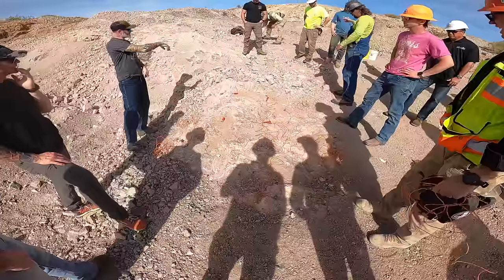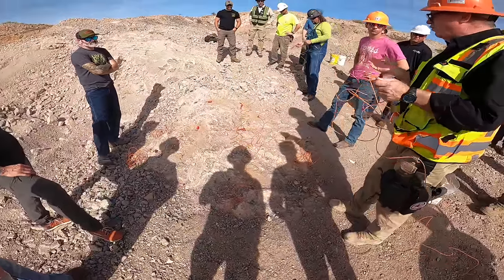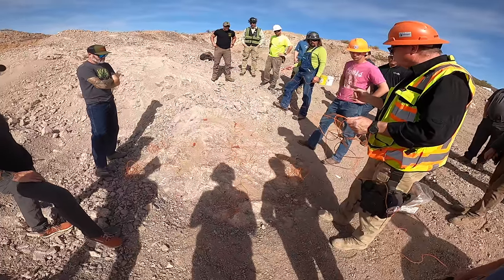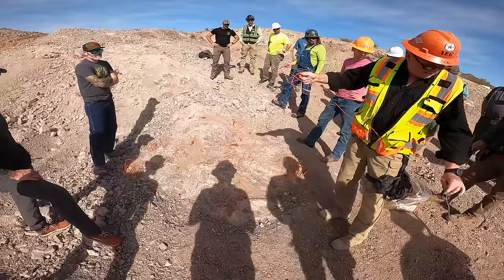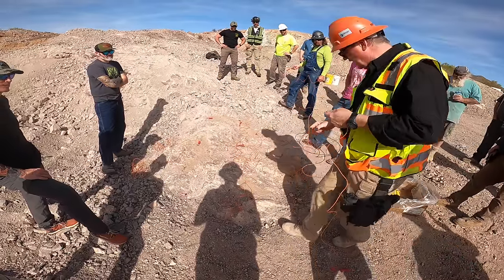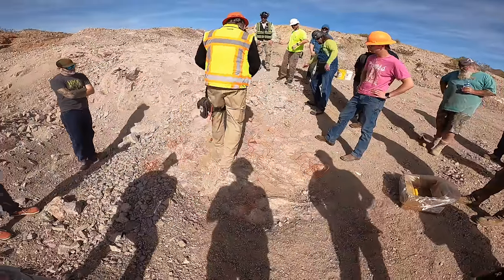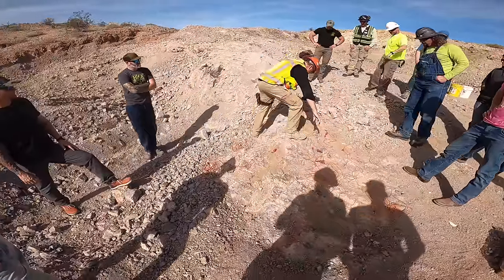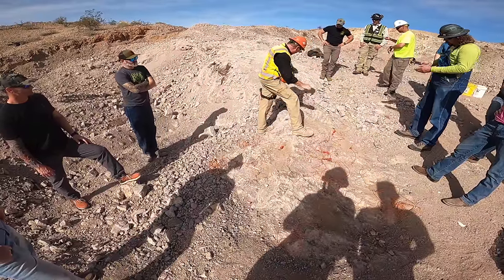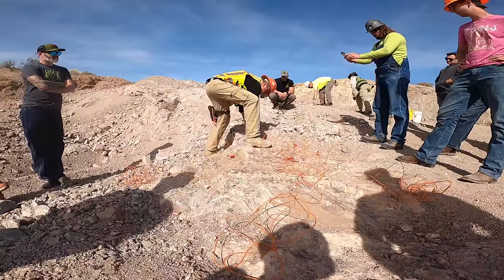Yeah, ideally we'd want about 42 milliseconds. I don't have 42 millisecond surface connectors, so we're going to use 25 caps and I cut the cap off the end. So how this works is like this. This guy comes down here like it's a regular surface connector. And a lot of guys will do, if the line's been cut, they'll put a knot on the end. This guy ties in here.